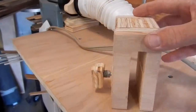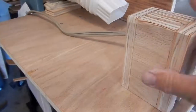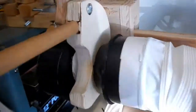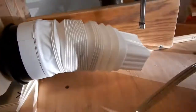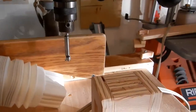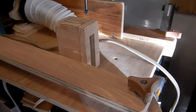There is the block — completed, sanded, and pretty accurate. That thing will go on the saw stop. I did modify my fence so that doesn't happen anymore — pushed it down to where I can get my dust collection system slid out over the end of it. Now that I've got a good clamping method with one of these — same as that one over there, except this has got the hole drilled in it — I kept that from spinning with one screw in the end into a dowel. Doing good on the dust collection, modified the fence, cleaned it up, sanded it. Sanded my fence up a little bit and sanded up the auxiliary fence for out here in the front for when I want to run a board between them and slide it through. It's coming together.